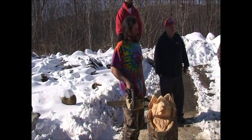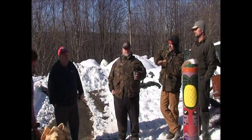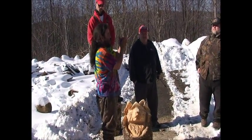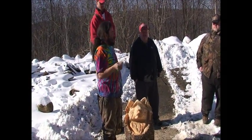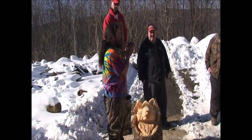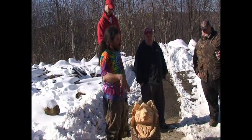So that angle you take, cutting underneath the top flat, that means a lot. I try to keep it at 45 degrees the whole way. If you get a sharper tooth, it'll cut like crazy for 5 minutes. But then the first little piece of sand you hit or a really hard knot, it'll get the edge of that tooth folded over and then you're dull. The 45 degree angle helps in the making of the chip.